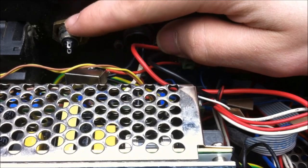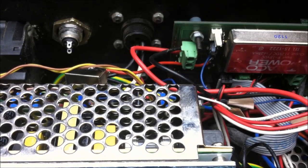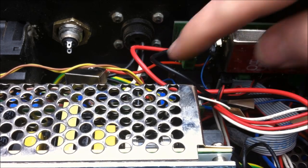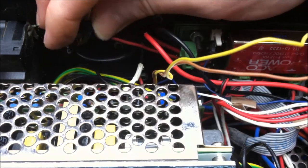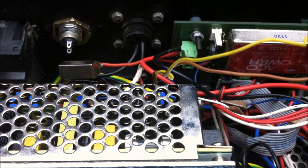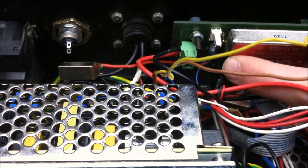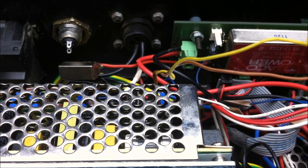Putting that lock in was not easy. The metal on the outside I had expanded just a little bit, so I figured cut out all that struggle video work, get straight to soldering. So this wire coming off this test switch in the back, it's not long enough to reach over to the key interlock on the back, so I'm going to be putting on a longer wire on the back. I'm also going to put some hot glue on those spare connections once they're soldered on. That way I don't have to worry about anything getting in to those.